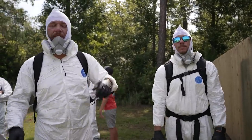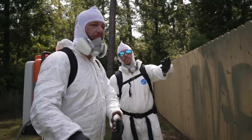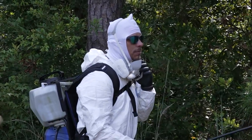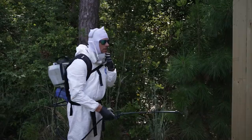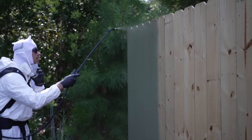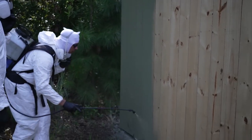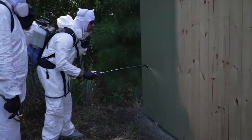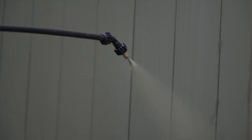We wrote some marks on the fence here to prove that when we get done staining you won't be able to see them, even though they'll have sat for about 10 minutes. What we want to do is coat it at about 125 to 150 square feet per gallon — that's going to be a very heavy coat. You can see it's almost dripping down the fence.